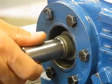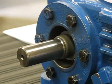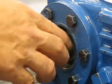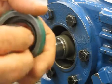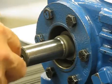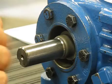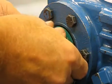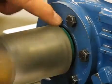We have the pinion in. Make sure there are no sharp edges on the keyway or anything like that. Now we grease the outside and inside of the lip and also put some grease on here. In our factory we have a protection to help the lip seal and spring together, but if you don't have that, try to find a sleeve that works. Just make sure it's greased very, very well. Put it over the pinion and find something that's flush to hit flush with the carrier.